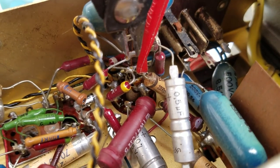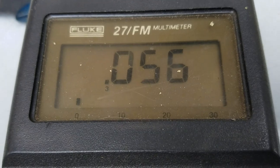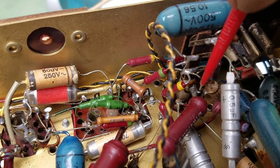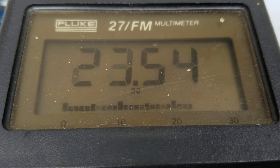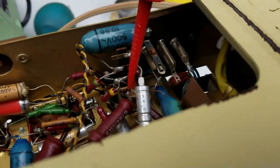I'm going to clip this capacitor out. It went to zero volts and you can hear the audio woke up a little bit. You can see the DC leakage through the capacitor there — it's not shorted but it's leaky, and that leakage will destroy that tube.